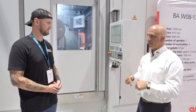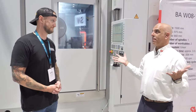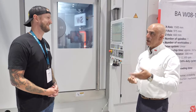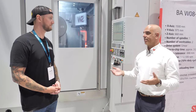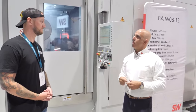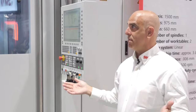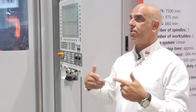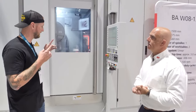The other big benefit of linear drives is that maintenance cost goes down significantly versus ball screw applications. In our machine tool business, you are going to replace ball screws from time to time, and they're expensive and time-consuming to replace. With linear motors we just don't have those failures. Anecdotally, in the last two years, for every one linear motor we've sold we've sold 25 ball screws — but that gives you an idea of the reduced maintenance cost and hours, which ultimately translates into less manpower spent on maintenance.